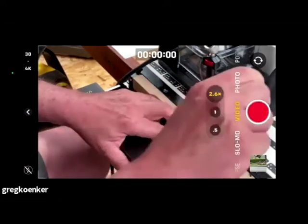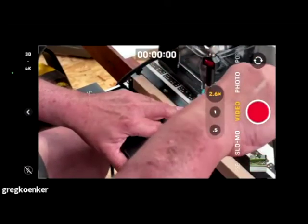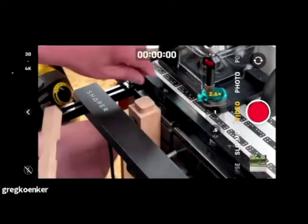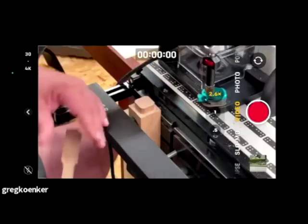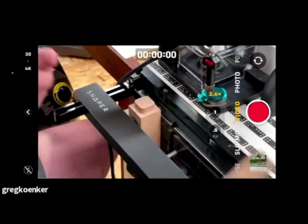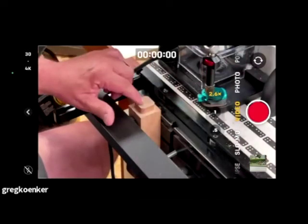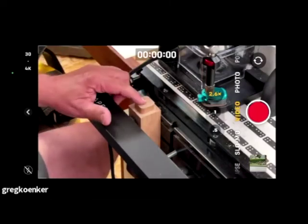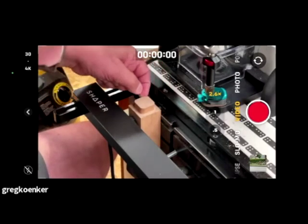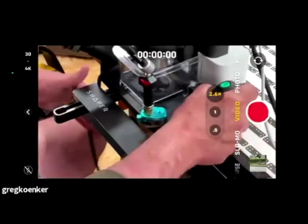But, you know, if you can't make a mistake when you're showing a bunch of people stuff, then what's the fun in it? So those are designed to push the piece of waste board against your project, so you don't get that happening. But that's okay. Now we don't need it because we just have to worry about the middle. So what are we doing here? Well, I'm just going to go down 1/4 inch this time, and I'm going to cut out the circle here. So let's go ahead and do that.